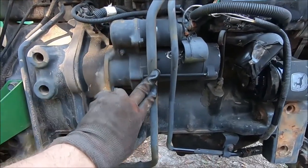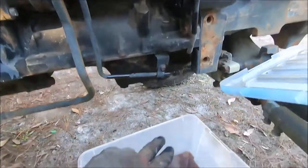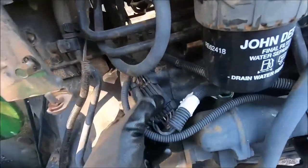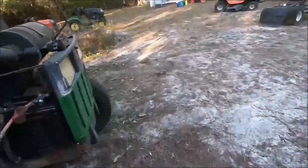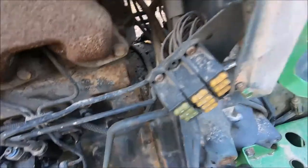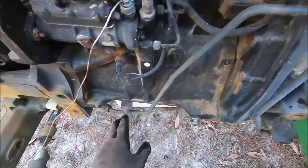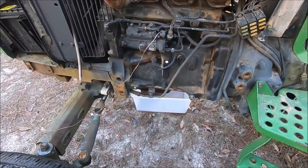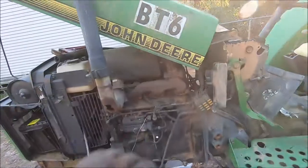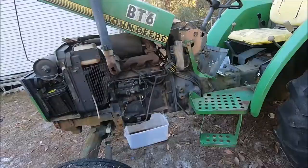The high pressure hydraulic line from the pump we're going to disconnect here — that's already draining. We've got to pull this fuel line and our electrical connectors. On the other side we have to disconnect the throttle shaft, which is just a pin. The steering line on that side we'll also disconnect and take it backwards with the main unit. I've got to pull the hood off because it's going to stay with this part and we'll lose our hood prop — just a couple of bolts.